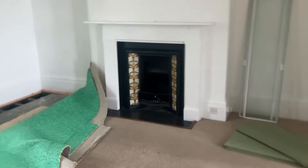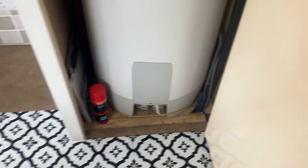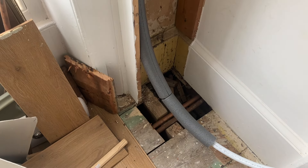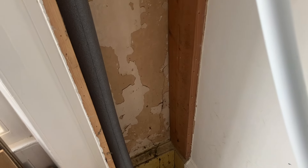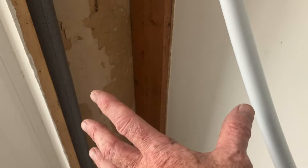If we go into the lounge — I've had to pull the floorboard up because I need to get the hot and cold supply to go upstairs into the proposed bathroom. It's all inaccessible in there, so this is where the pipes come out, hot and cold, which were the feed to the bathroom I've just removed. What I've done is fitted two three-quarter inch pipes up a boxing and they go all the way up to the third floor so they can be connected into the hot and cold going through there from the heater. I'm going to have to tee off here for the sink — I'll show you more upstairs in a minute.